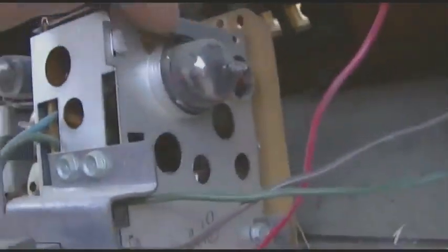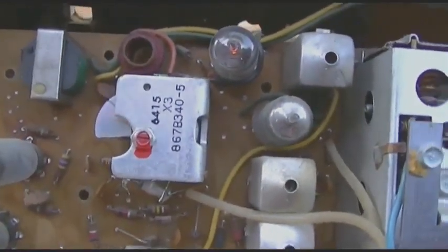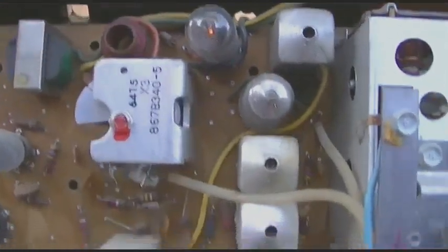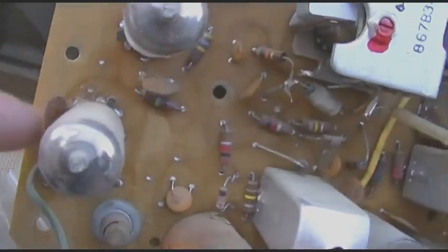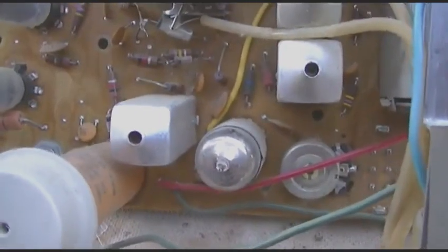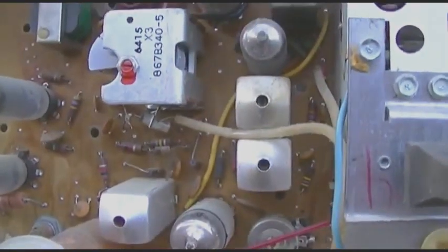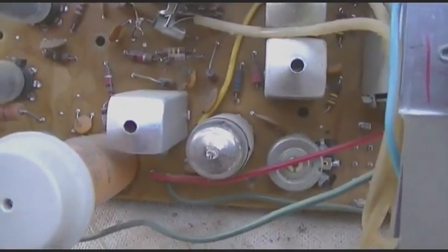The FM tuner assembly is right here, and then this is the AM tuning capacitor and the oscillator coil and IF cans and typical GE. Everything is disc cap in this. Disc here, here, here. All discs. Nothing but discs. Surprised they didn't just use a stack of discs instead of an electrolytic. But it turned out that cheap move, the radios actually lasted a lot better.